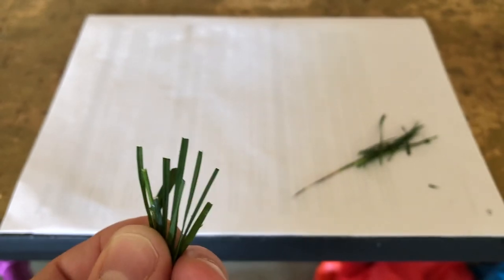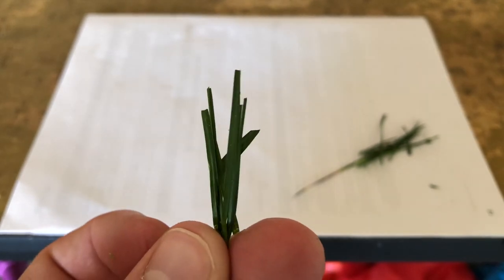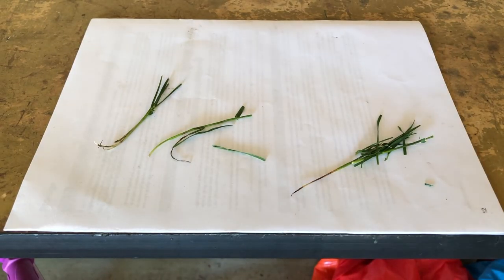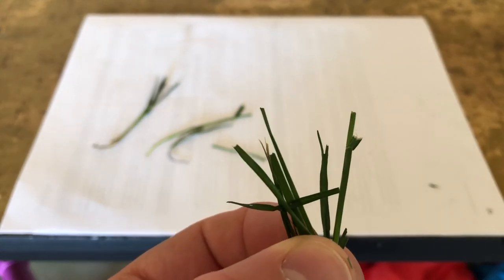I learned something here. I didn't think it was going to make that big of a difference, but it actually made a pretty big difference. So I'm going to get that other blade off and sharpen it right away before I keep hacking my grass apart. Keep those blades sharp — the stock grind is not as good as one you've sharpened with a grinder and a flap disc.